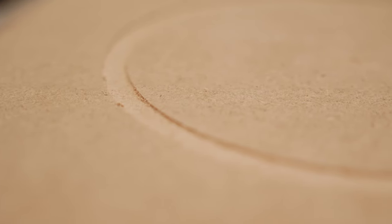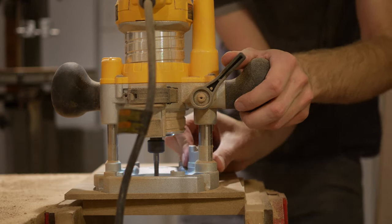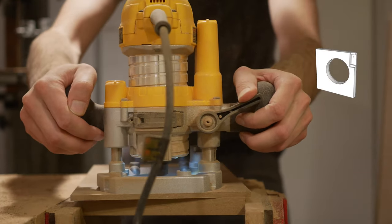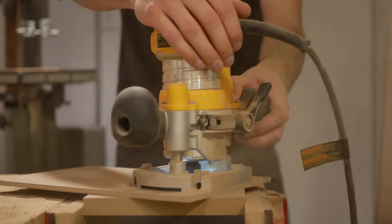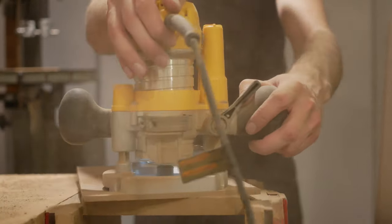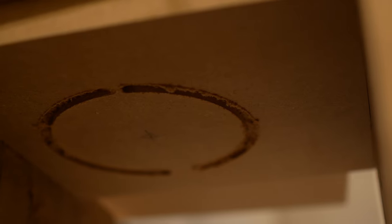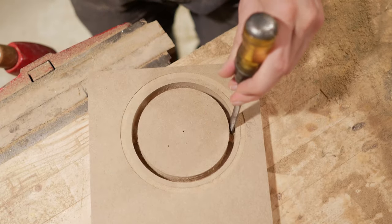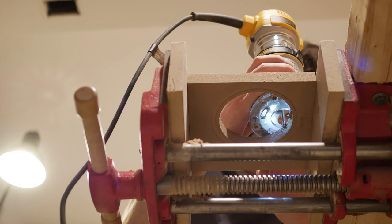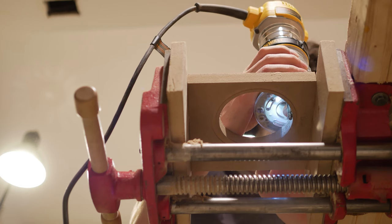I cut the groove around for the gasket, and now I can use the same router and compass on one single side to cut the opening for the pipe to enter. I'm going to use this first side as a template for the other sides. The hole took a few tries with the compass to get the correct diameter for a perfect fit. When using a router with a compass to make a complete circle, make sure to leave some tabs so the workpiece is supported — otherwise it'll spaz out and ruin it. Take a router with a flush trim bit and flush off those tabs after.